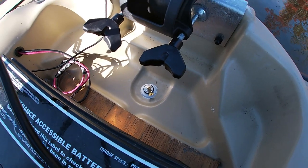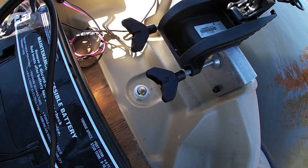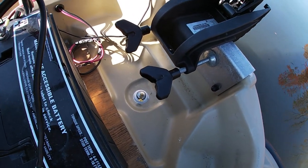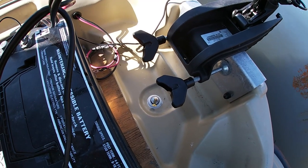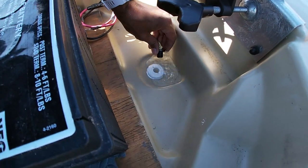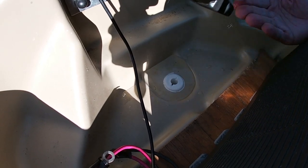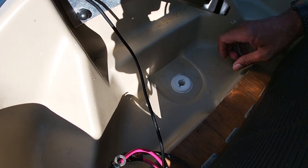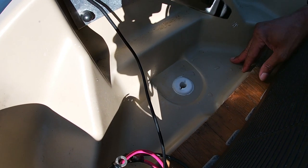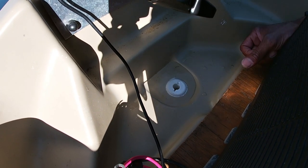One week later — we're out on the water testing the plug. Absolutely no leaking; sealed up really well. I'm curious whether removing the plug while on the water will let water in, since the plug outlet is below the water line. Testing it — yes, water does come in and sit in the little cutout, then goes back down depending on the boat's weight and movement. So technically you could keep it unplugged the entire time and accumulated water will drain out as you fish. Really cool experiment — super satisfied with this mod.